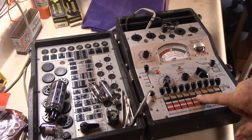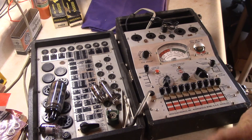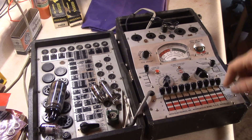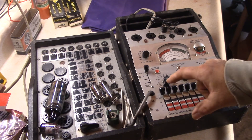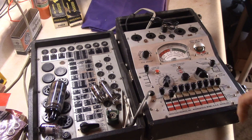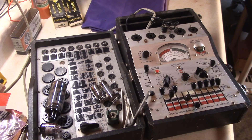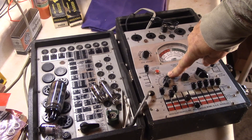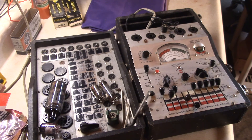You have four different levels of settings, but for most all tubes you just use the bottom three. I'm going to name them one, two, and three. For the 12AX7 setting, you take switch one and put it in the first position, then second and third position. Make sure your voltage is on 12 volts, and over here is the load — set to 90 for the 12AX7.